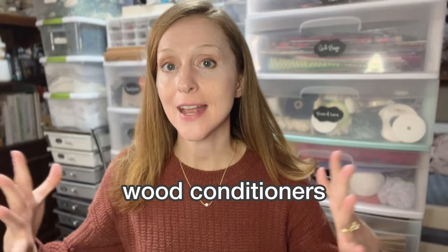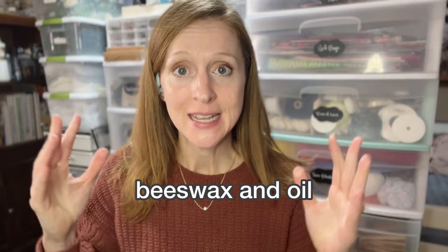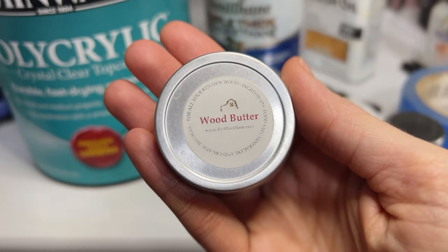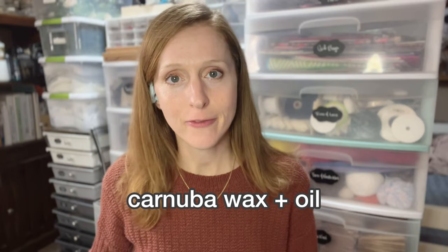After you've added your oils, you definitely want to add a conditioner over the top. Some of my favorites are Butcher Block Conditioner — a natural pairing with the Butcher Block Oil. I also love to use my own personal recipe of beeswax and oil; my customers absolutely adore that. I use mineral oil and beeswax, but you're welcome to use a different oil. You can also use carnauba wax instead of beeswax — more plant-based, and customers really love that too. Odie's Oil is another really good option — it's natural, dries solid just like tung oil, and comes in a light universal finish or a dark finish.